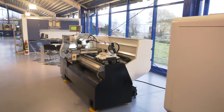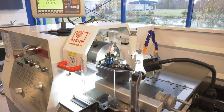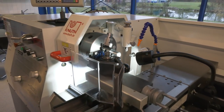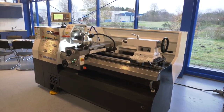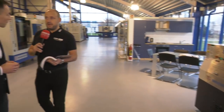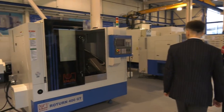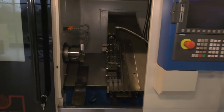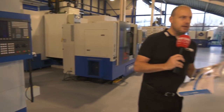I like this too. Often we're looking at full spec CNCs, performance machines — this is a totally different end: tool room. Where do you score with these kind of machines? These are aimed at customers who have maintenance departments and workshops and need a little bit higher quality from a conventional lathe. This is actually our own design — a servo conventional lathe based on mineral casting. And this machine here has a platen on it — it's a fixed head machine with a platen, for customers who have very particular production and workpiece designs, looking for good pricing with a compact design.